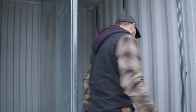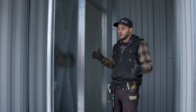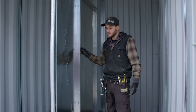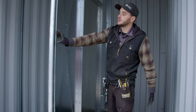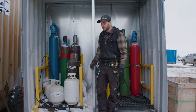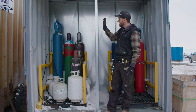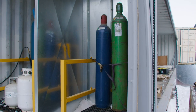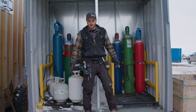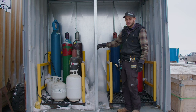Here is the finished wall. On the other side, that's what we call the framed wall. What we could do here yet — say if that was the storage side of an office-storage combo — we can still spray foam insulate this two-inch cavity. And then with these return folds, we have something to screw what we typically use as a reline wall panel. Just to give you an idea of these partition walls and how they work, we have one going crossways in this container — this is our own container that we use in our shop. We actually have a wall coming out to separate our fuels and inerts versus the oxidizers. We're using the rest of it with a roll tarp door for lay-down yard storage. We decided it's a great place to try out our kind of prototypes for our partition wall kits, and they seem to work great for this.